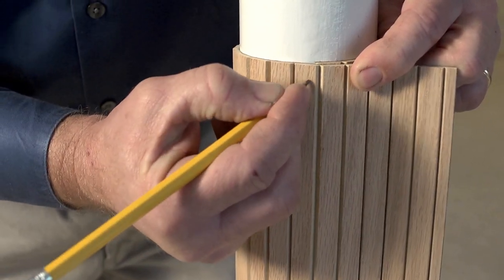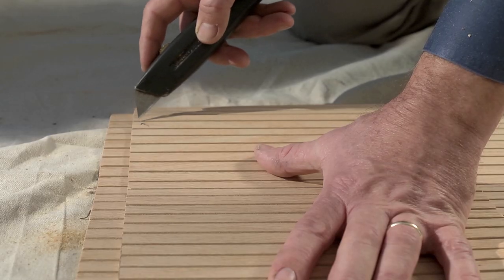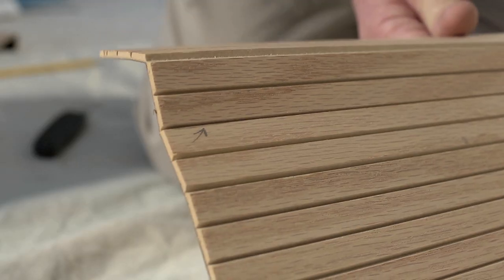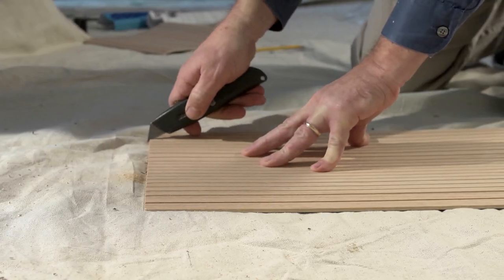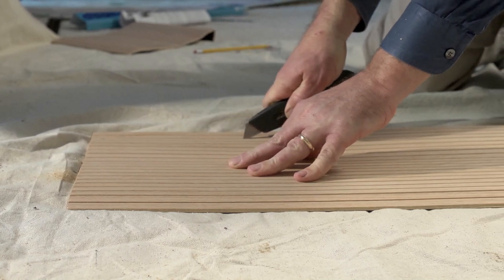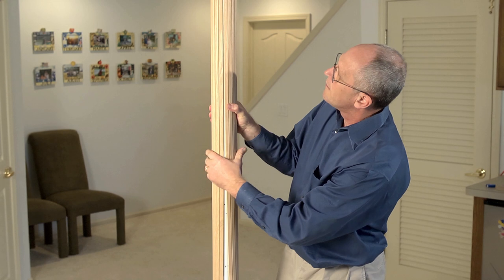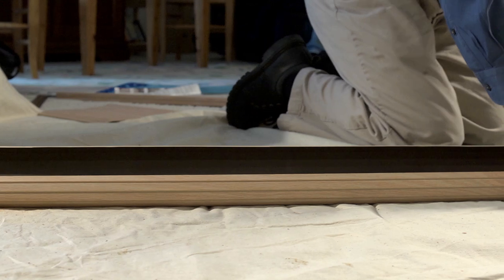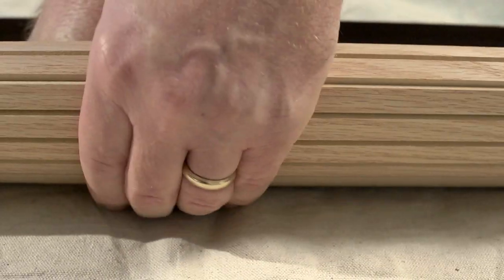Next, use the small piece remaining after cutting Pole Wrap to determine which groove slat to follow when cutting lengthwise. Based on this calculation, use the utility knife to cut the width of the pole wrap along the V-groove so that it just overlaps when you wrap it around the pole. Remember, when you apply the adhesive later, it will take up space, which will eliminate this overlap and produce an invisible seam. Now lay the pole wrap flat, and fold and roll it to break down the slats and ensure that it will wrap perfectly around the pole.